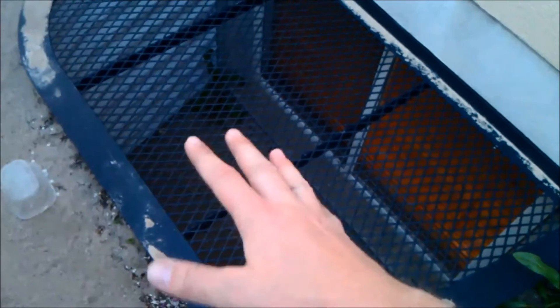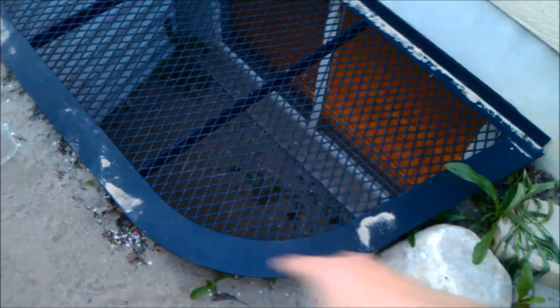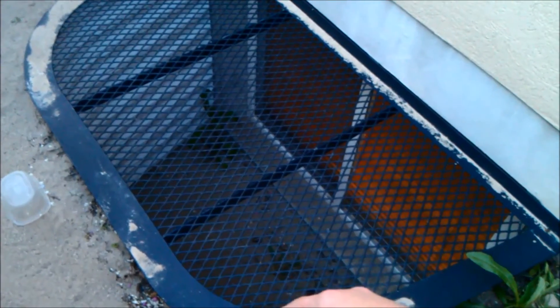This flat bar allows for a lot of slop - you can build these window well covers in a standard format and if they're a little bent it allows for that. My sister has a much older home with window wells that are probably only about half as steep and a little crooked. I'm going to design a window well cover based on a picture using the Torchmate to cut these corners, because if you were to try to bend that three or four inches you'd need hydraulics.